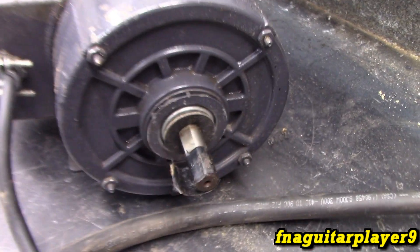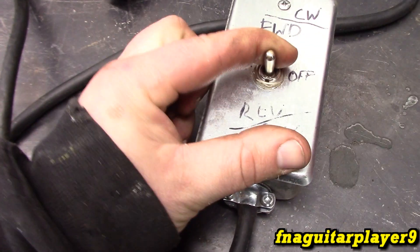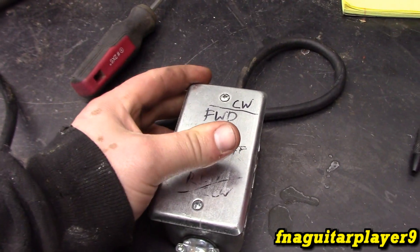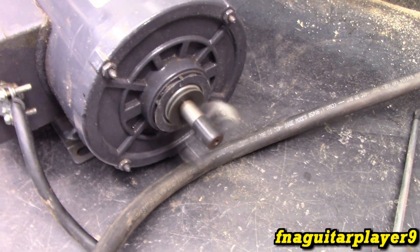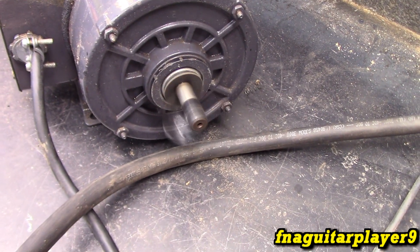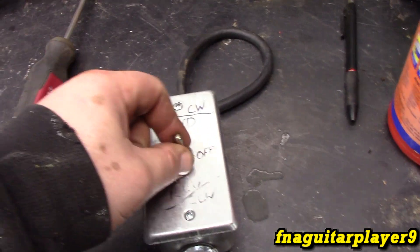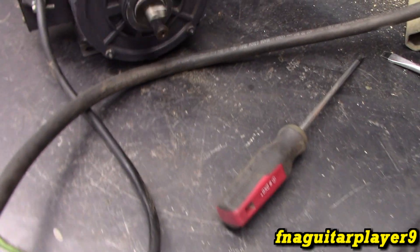When you flip this, the motor hums either way you put it. But what you can do — a lot of people do this — you can wrap a rope around there and start it like a lawnmower engine almost. As long as it's spinning it'll take off, and it'll actually generate the third phase. This is how a rotary phase converter works. I discovered this accidentally just messing around.